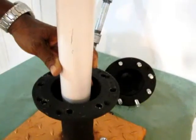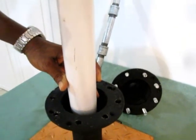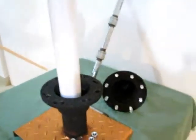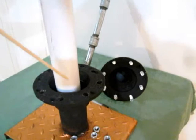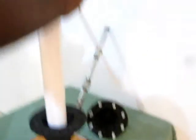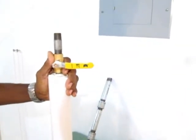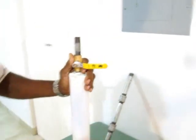Once the plug is installed, secure and made rigid, nothing gets into the pipe at this point other than gas and oil. When that is secured, all you need to do is turn the valve to a shut position, therefore sealing the leak. The beauty about this device is it allows you to either stop the leak or stop and retrieve.